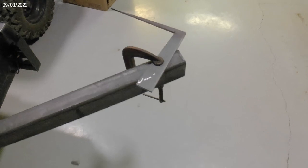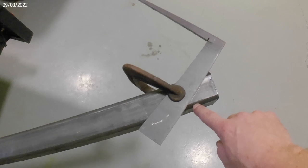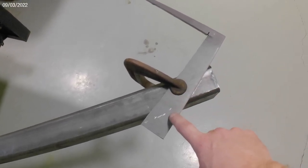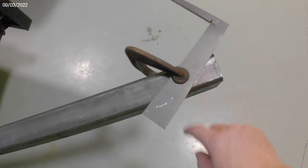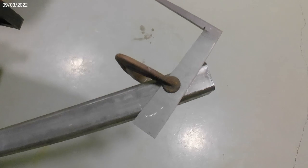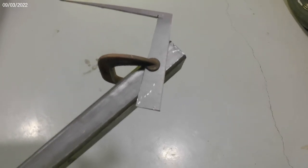Here's my setup for the first cut. I marked my two spots, drew a line, and then remembered I had this piece of scrap with a pretty nice factory straight edge on it. So I grabbed that and C-clamped it on — that's going to be my guide so I'm not free-handing this cut. I'm going to grab the angle grinder and get her done.